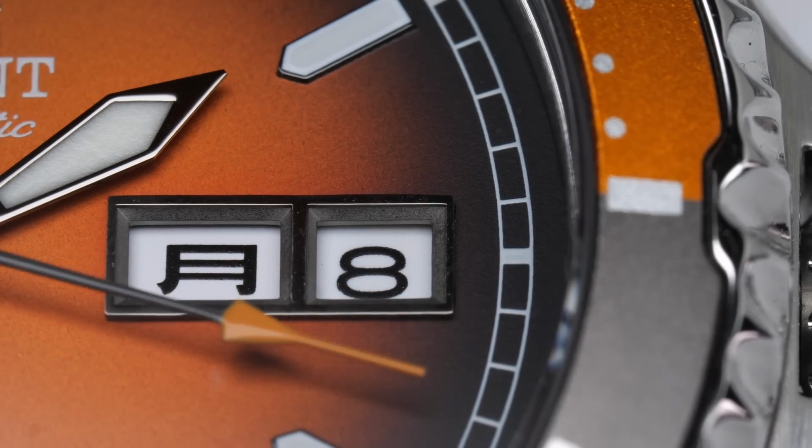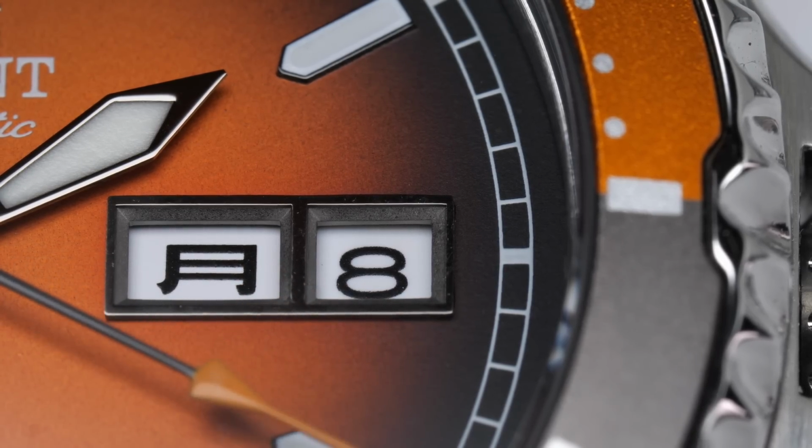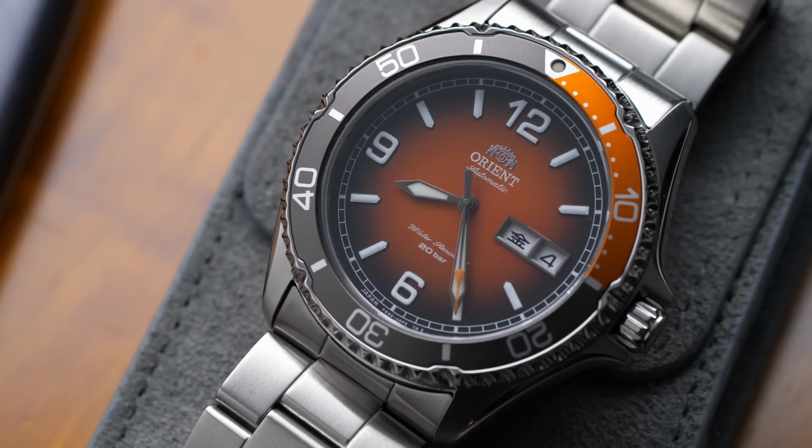And finally, just because the Seiko NH series of movements are so insanely popular, long-term it would be easier to replace a Seiko movement than an Orient movement, or to get it serviced. But Epson, which owns Orient, does issue an unbranded Orient movement, the YN55, so if you did need to replace the movement, you could get one of those and it should probably work fine.